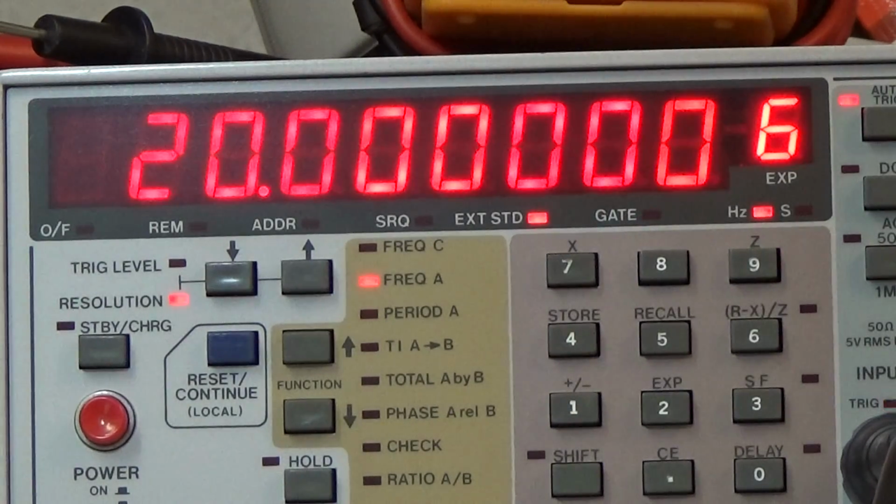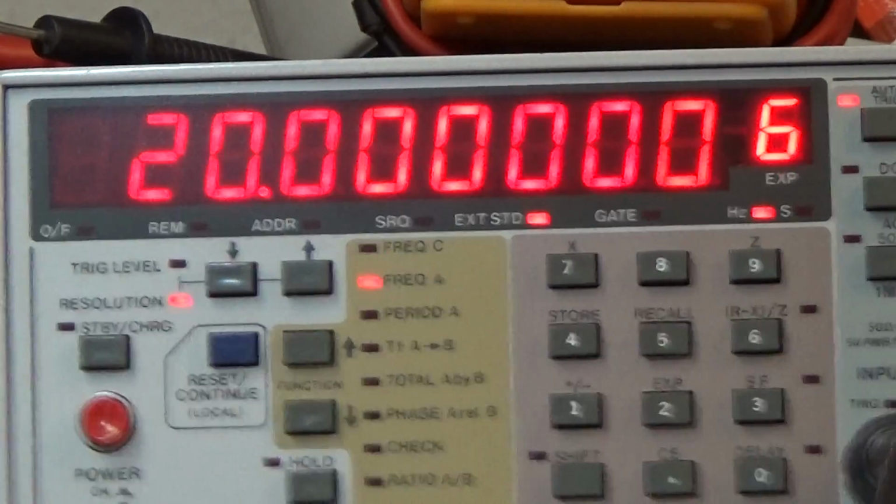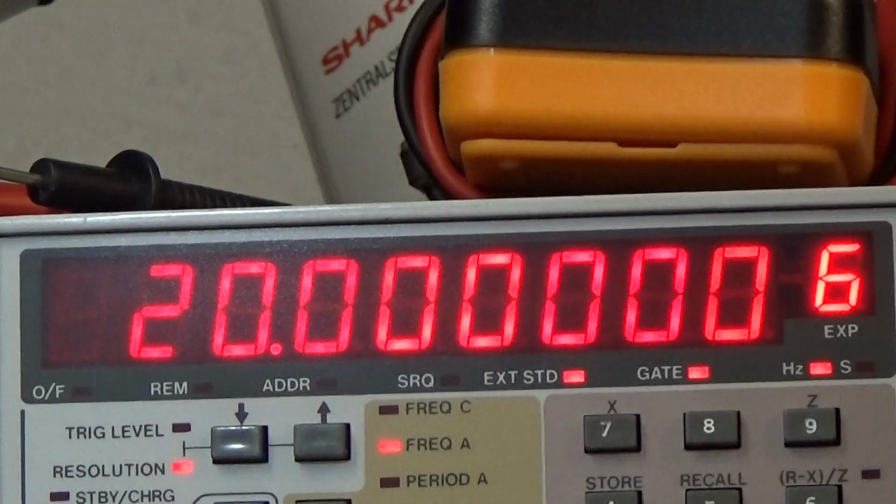Okay, so that has taken a while, and as you can see, it is within 1 hertz tolerance, and our allowed delta is plus minus 20. But now we may already have a temperature impact. So what I'm going to do right now, I leave it as it is, and I put the shielding over it to get the right temperature, and then we are going to check it once again. I've once again readjusted it, and you see it is absolutely on frequency, so that is okay.